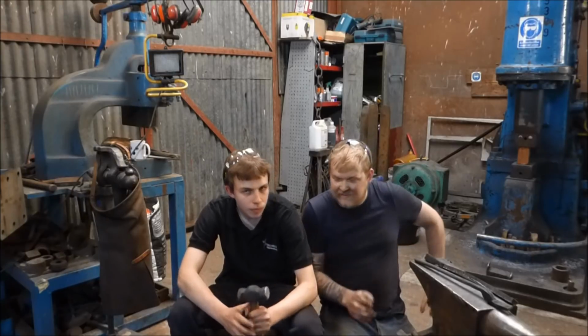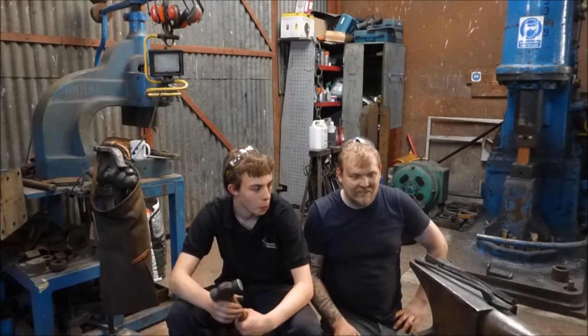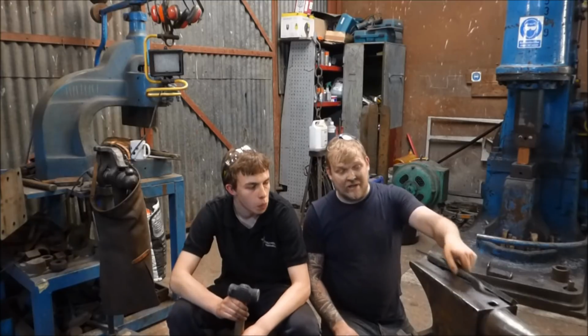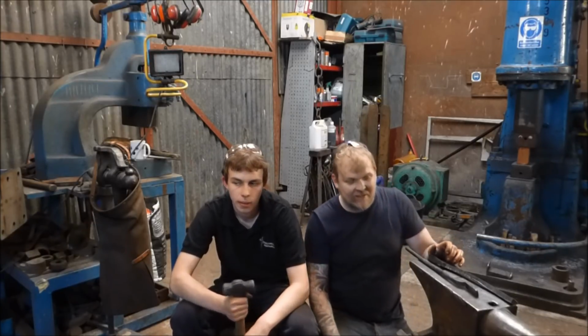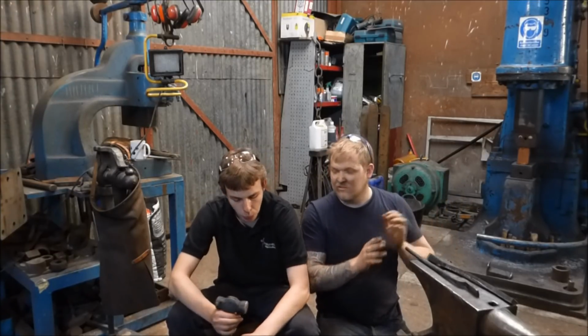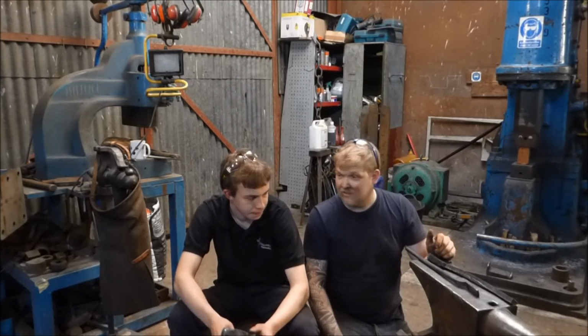I know how to fix it, I think, but I don't think it's much better than drawing it out. I think drawing out's quicker, especially if you haven't got a striker. This will take a long time on your own. But what I'll do is leave a link to a couple of videos that I used. The one video I did watch was some farriers making a set, and they make a really pucker set, but they did have lots of top tooling, and I was sort of umming and ahhing about getting into top tooling. For this, all you need is a chisel and probably a flatter and someone with a sledgehammer, so it's reasonably low tooling. If you haven't got a chisel and a flatter, you're short a few blacksmith tools, I think.